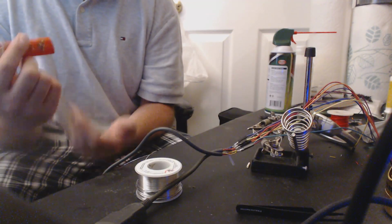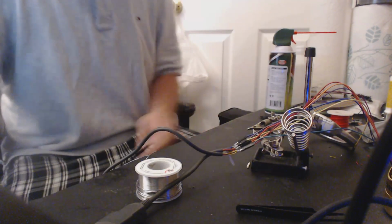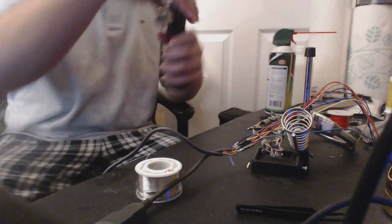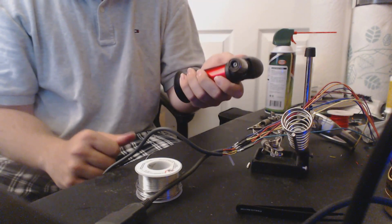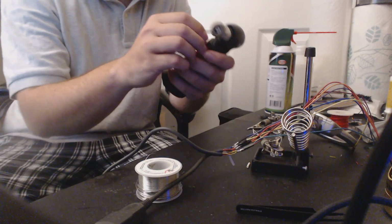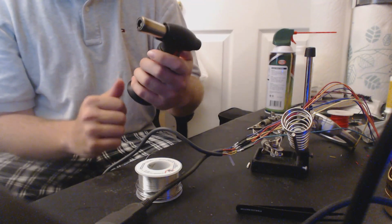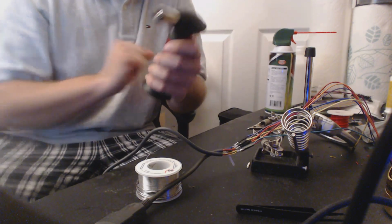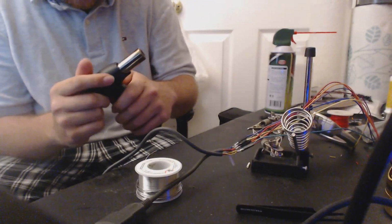It was so bad, man. The heat shrink looks so bad. Don't use a cigarette lighter. It's a last case scenario kind of a deal, but don't use a cigarette lighter. Use a butane torch. Much better heat dispersal in a concentrated spot. And then it's also fun. Why not use a match? I don't know, DJ, you watch me do this first one and then tell me if you would do it with a match, okay? That's all I have to say about that.